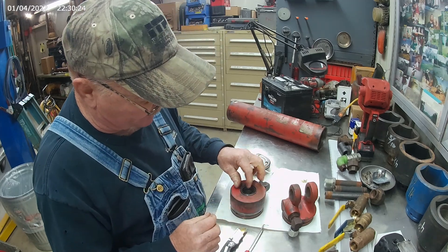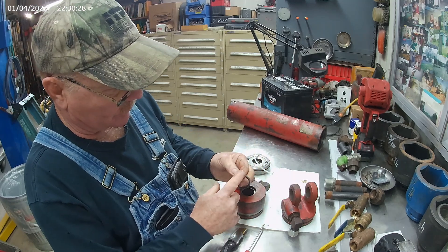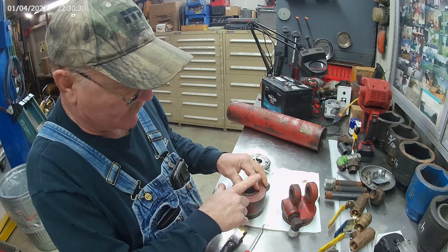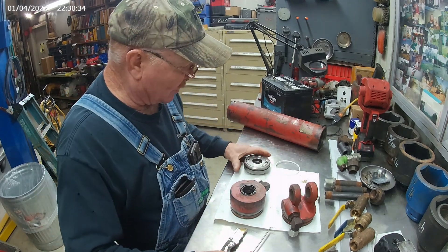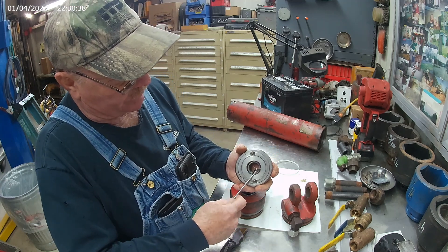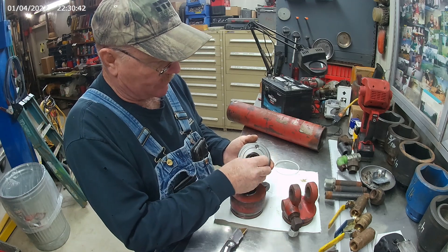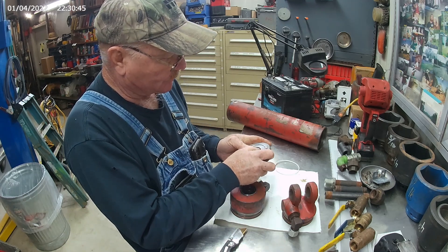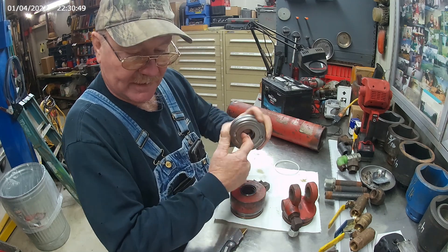The wiper ring is a metal-backed wiper ring, so we'll put a little bit of red silicone or red Loctite on there and tap it down in there. There's one more that's hidden — it's on the inside of the piston where it goes onto the shaft. It's got an o-ring. Change that, put a new o-ring in there.